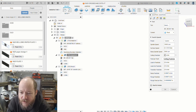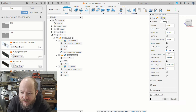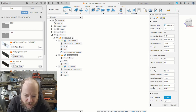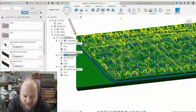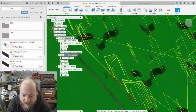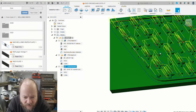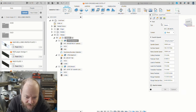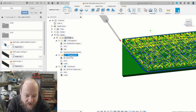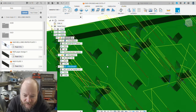I think twenty ten-thousandths per tooth would be okay. The optimal load setting is important. And then looking at the final toolpath, it just goes into these corners and cleans up the last bits. Then I come in with a chamfer mill to clean up just the last little bits — hopefully that will get us into really tight spots and clean up the corners of the crosses and stuff.